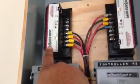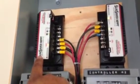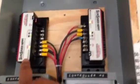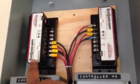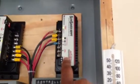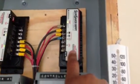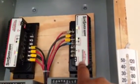This charge controller is hooked to my first solar array — basically two 12-volt panels in series for a total that will get up to around 40 volts. Today is a really clear, sunny day and it's relatively cool, and the voltage got to 40 volts. This second charge controller is connected to my second array with two 24-volt panels in series, and the voltage is around 60 volts. The maximum that these charge controllers will handle is around 70 to 75 volts.